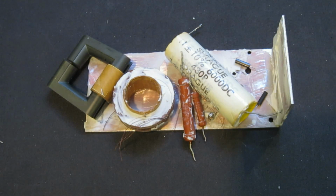Well, folks, I'm afraid I have some bad news. Remember last time when I mentioned that one of the fault modes, besides the controller board and the transistors, could be the potted inverter circuit? In fact, that's exactly what was going on. Unfortunately, I didn't tape the whole thing, but I can give you a little rundown of what I discovered.